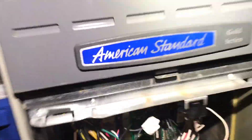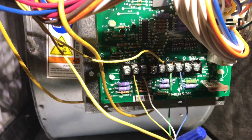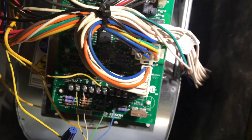When they're ever under warranty, it's always the safest bet — especially with it being a communicating variable speed system. You have this bottom slot right here that's not blinking right at the moment. It'll show how many CFMs it's reading and it communicates to that motor how much to ramp. Normally it's usually just the motor, but with it being under warranty, it's always safest to go ahead and do both. First thing we're gonna do is get this board mount — it's got two screws up here — take those off, swing the board out of the way, and then pull this blower.